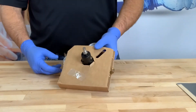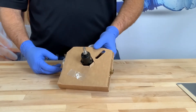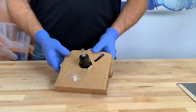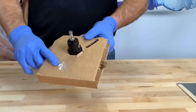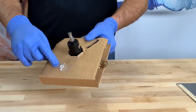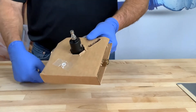This is the high-pressure CO2 regulator that Cresale sells along with the sparkling and still chilled water systems. One item taped onto the packaging is this quarter-inch flare washer, also known as a fisheye. It's important that you don't throw that away — we need to remove it and it's going to become the seal between the quarter-inch flare fitting and the bottom of the regulator.